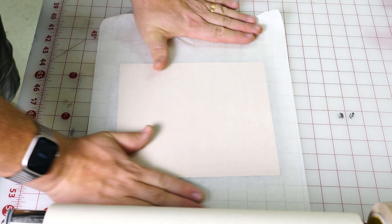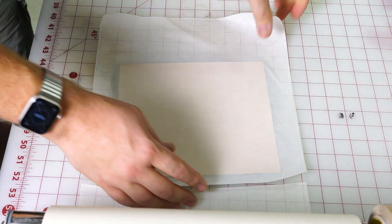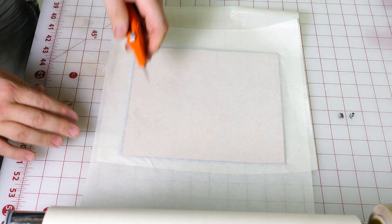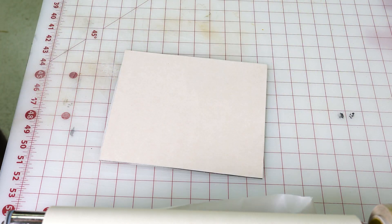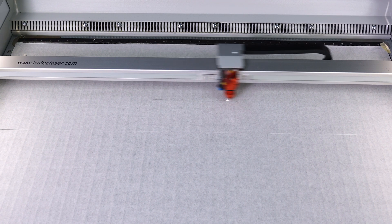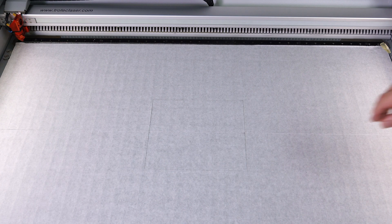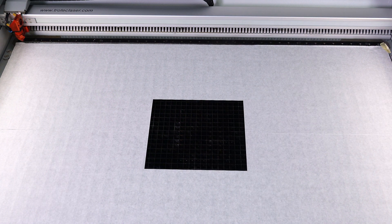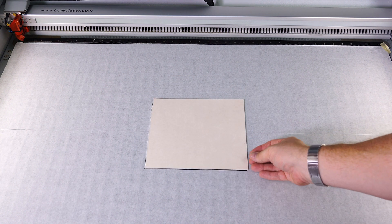To start I will use the laser to cut some leather blanks. To do that, the raw leather must be masked to protect the surface from the heat of the laser cutting process. Mask both sides of the leather then squeegee any air bubbles from the masking. When laser cutting or engraving leather, for best results a vacuum cutting table is recommended. To create a vacuum, cover the vector cutting grid with paper then laser cut a template into the paper the size of the leather. Remove that paper and place the leather over that opening. When the exhaust is engaged this will produce a vacuum and keep the leather perfectly flat during the lasering process.